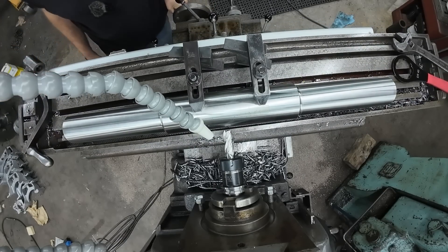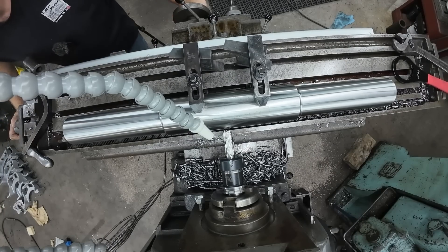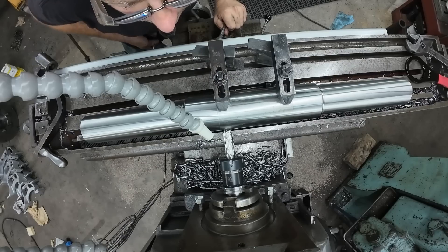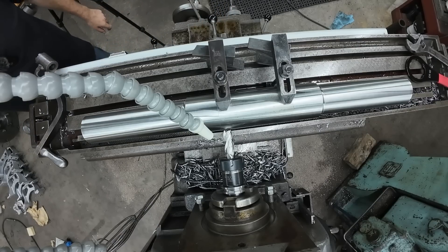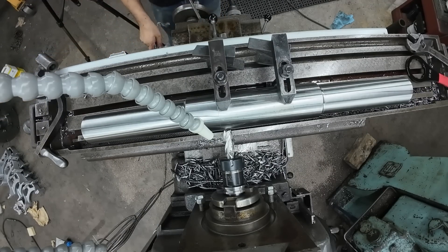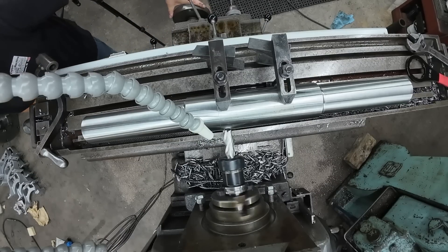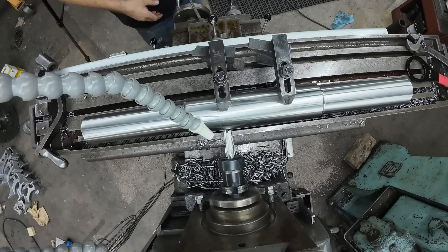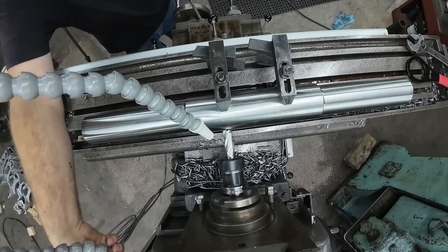The really hard part with this machine is visibility — I can't see what I'm doing because the cutter is on the opposite side of me. We're going to run 295 RPM; I think that'll be a good starting point. I'll bring it in to touch it off, zero my readout, lock everything down so nothing moves on me.